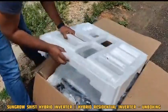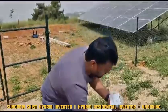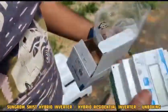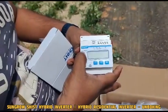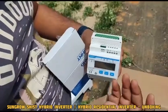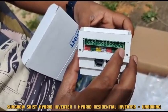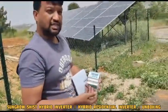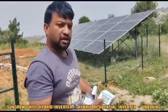Next, I want to show what tools we get in the box. This is the meter — the DTSU 666-20. There is a difference between the old one and the new meter. The old one is only the DTSU 666; now it is the DTSU 666-20. It's a new upgrade. Comparing with the old one, we have an ethernet switch and different grid CT ports. In the old DTSU 666, we don't have CT connections — that is, inbuilt CTs — but here we need to add external CTs. The CT connections and the phase connections are done like a normal external meter.